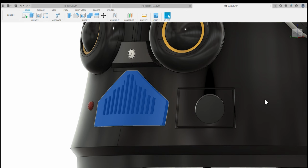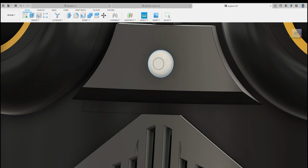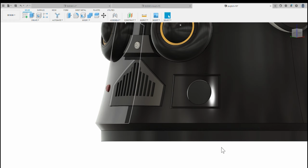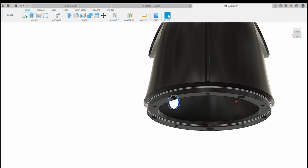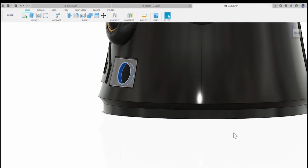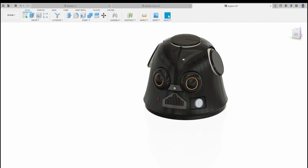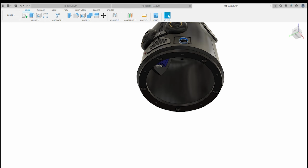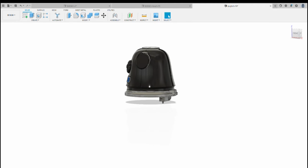So that's your eyes, and then you've got this mouth, a little greeble, and there are a couple of holes there for, I think, 5 millimeter LEDs. If you want to put an LED in the nose, the hole's 5.5 millimeters, so it's easy to fit 5 mil LEDs. And then you've got space there if you wanted to add a PSI light, just through a piece of opaque plastic. So you can add a couple of lights, a PSI light, you've got ears that flap, all of those drop through to the LazySusan through a slip ring, and can then be powered and controlled from the main body.